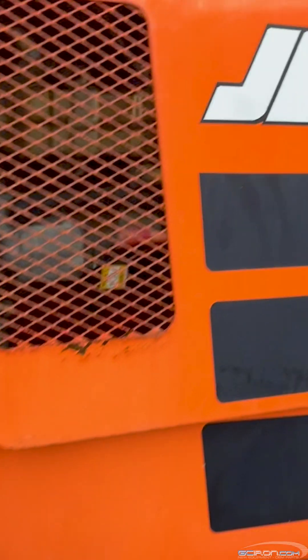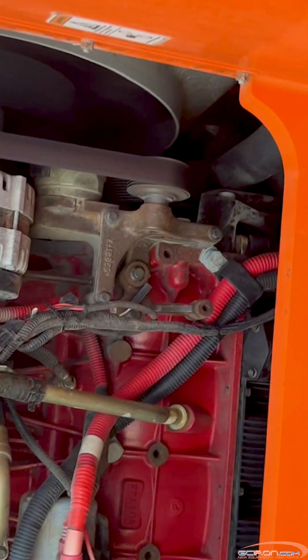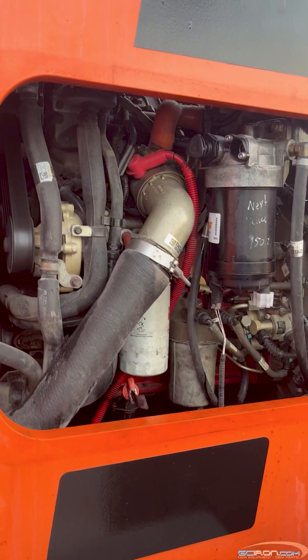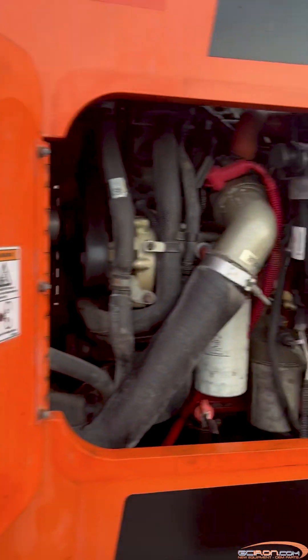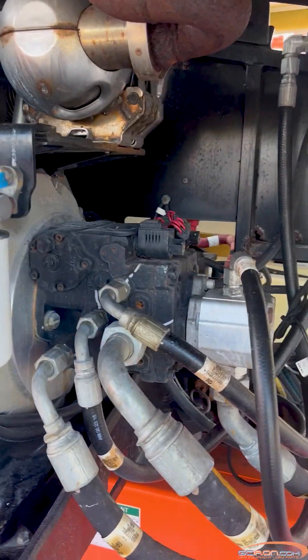Step 5: After verifying the park brake switch is good, locate the starter lockout relay located under the radiator. To gain access to the starter lockout relay, the angle bracket cover will need to be removed from the outside bottom edge of the engine pod. The starter lockout relay is a Bosch-style relay bolted to the side of the box under the radiator, closest to the frame of the machine. With the assistance of another technician or machine operator to keep the key switch in the start position, verify 12 volts on the orange wire labeled start relay at terminal 30, pin 1. If there is not 12 volts on the orange wire, a continuity test will need to be performed between the orange wire at the starter lockout relay and the orange wire at the park brake switch.